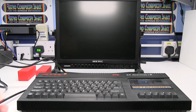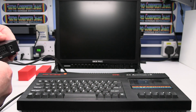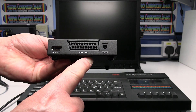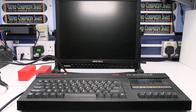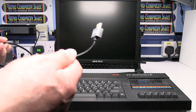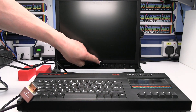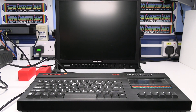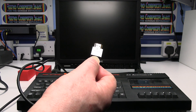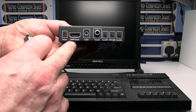Then connect the power supply. Next, connect the SCART plug at the other end of the SCART lead into the SCART input on the video converter. Then connect one end of an HDMI video lead to the HDMI input on your TV or monitor — this one's already connected. Connect the other end of the video lead to the HDMI output on the converter.